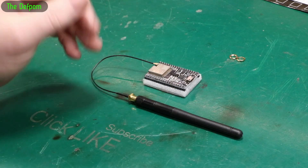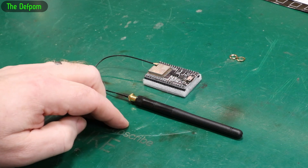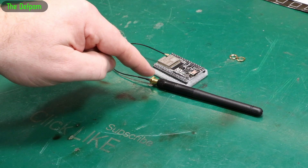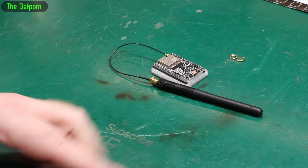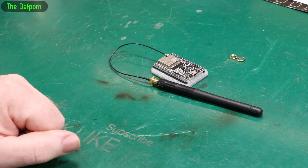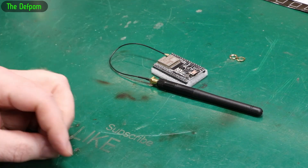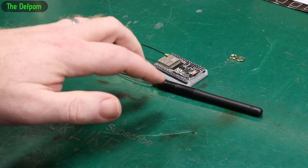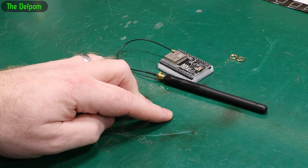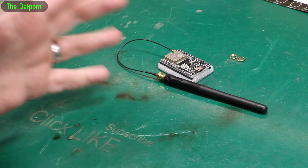Open up the code in Arduino IDE, go in and put your Wi-Fi SSID and password. This also needs an email account — you could share it with your personal one, but I'd recommend allocating a dedicated email address to this device so you know what's going on. You put your email address, the destination address, and the SMTP server credentials in the code.